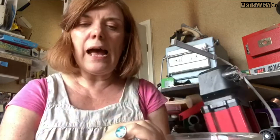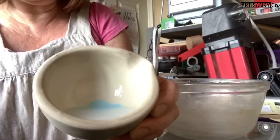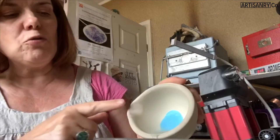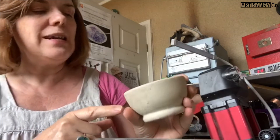Now I've been grinding this and I've got it nice and smooth. I'm going to pour it off into this bowl here and I'm going to rinse it until it looks clear. If you look here, you can see the enamel looks quite milky and you can see how the blue's settling — watch it settle — and then pour it off and you can see all the blue is being left in. And here I have now a nice, clean, freshly ground turquoise blue enamel that I can use for wet laying.